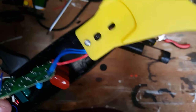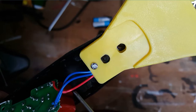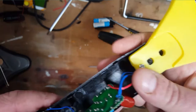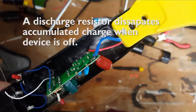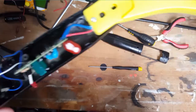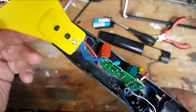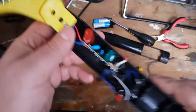Now you've got two wires coming out — those must be the outer meshes, and the middle wire is the middle mesh. When a fly comes along, it closes the circuit and the capacitor discharges immediately. One thing I like about this circuit is that if it wasn't for the LED, you could leave it switched on permanently. Once the charge is built up on the capacitor, no more current flows — where's it gonna go? You just wait for something to short out the meshes, that'll discharge the capacitor and the charging process starts again. You could short out the button, put this up against a light, and you'd have a pretty decent fly zapper that would just sit there attracting and killing flies.